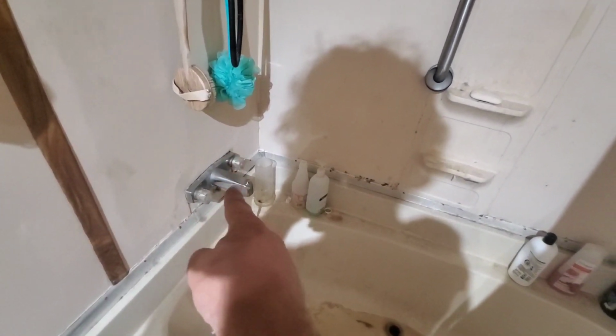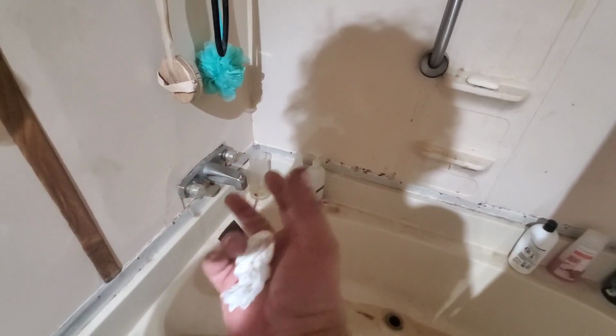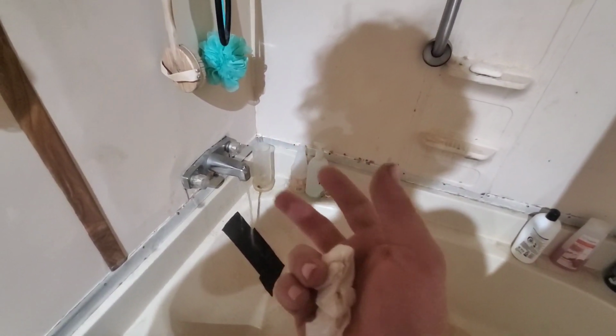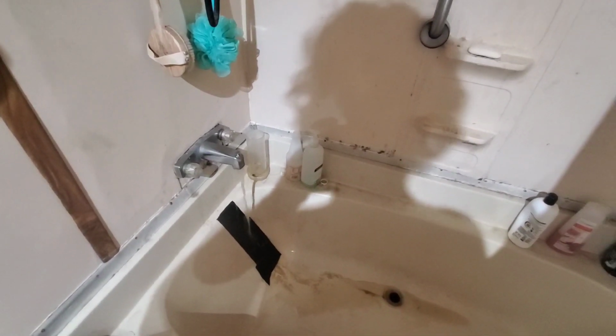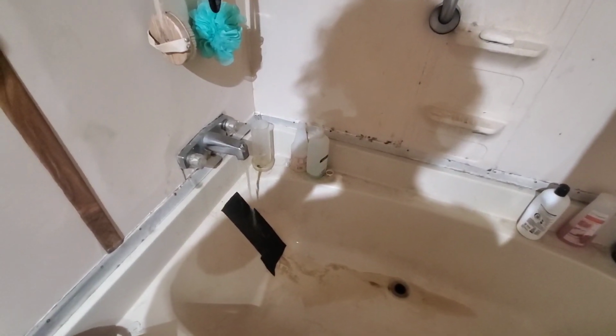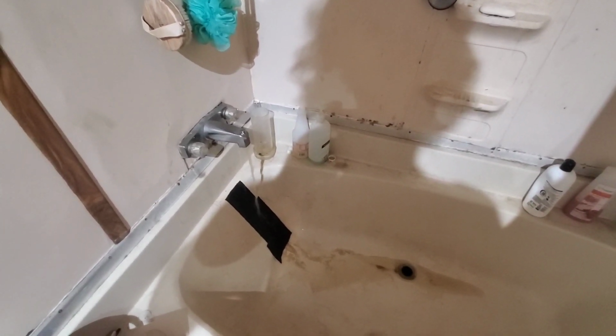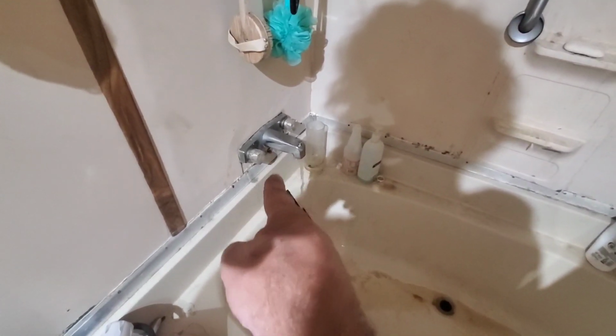And so you have to have a valve open, otherwise that air gets trapped in your tank, and when you turn your water on, it's going to sputter and spat and everything, unless you get that air out of your hot water tank. And that requires leaving this open for a while, at least in our situation, because of our bladder tank and our water pressure issues. We have pretty good water pressure, but not always, and as you can see, it's sludgy right now, so our well is probably struggling right now.